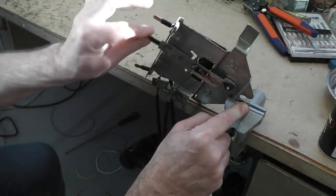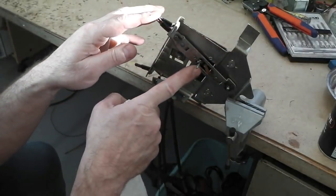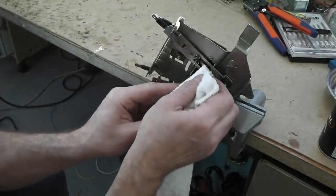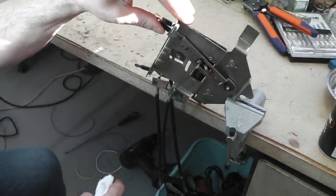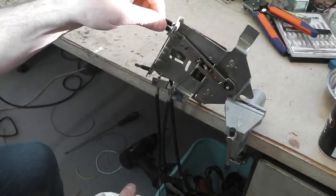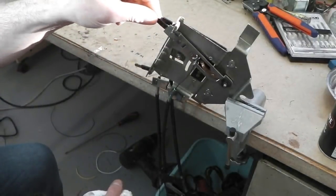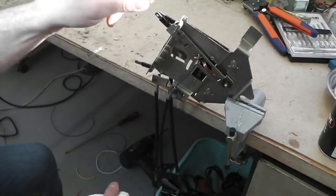Pull out, and this operating lever closes down the air vent for the hot, diverts all power to the fresh air vent, and when you pull out, puts full 12 volts to the fan, giving you fresh air boost. So by pushing that lever up, it's closed off the ducts to the heaters and the demisters, and this just operates all the air to the face vents only. That's a mechanical control on the flaps of the heater box. Then by pulling outwards in that position, and you can only do it in that position, boost only works for fresh air and gives you full 12 volts.